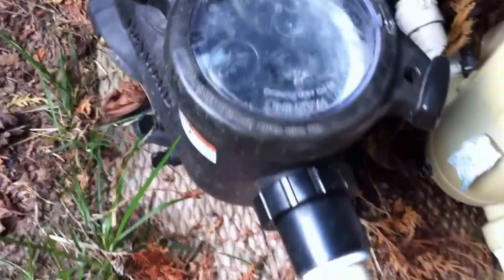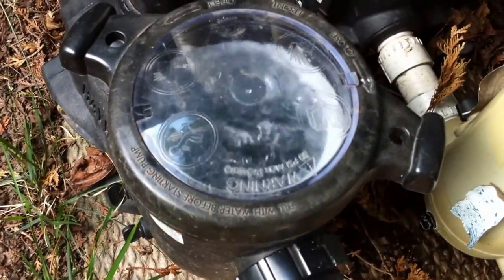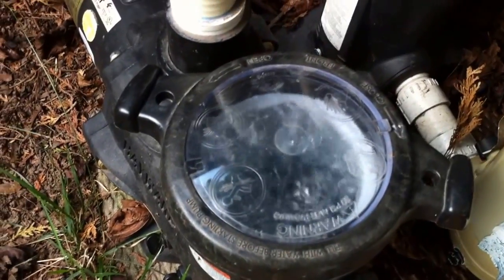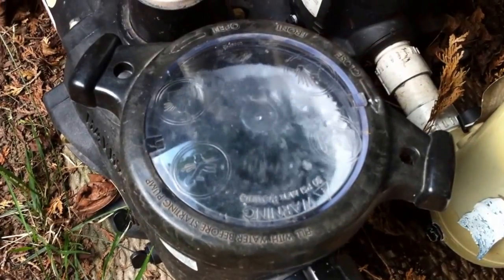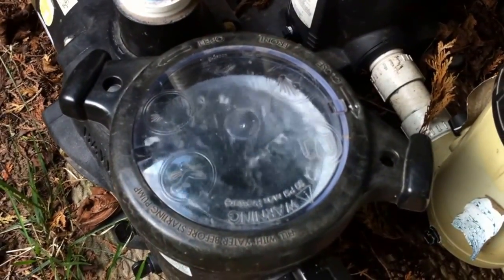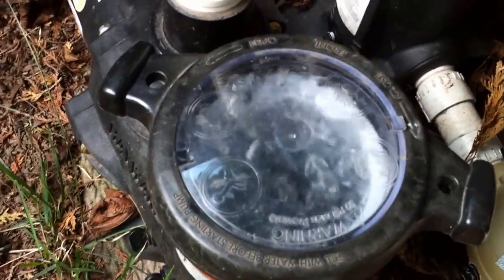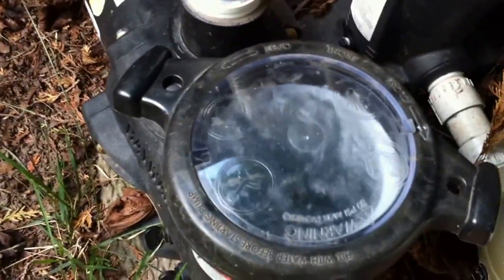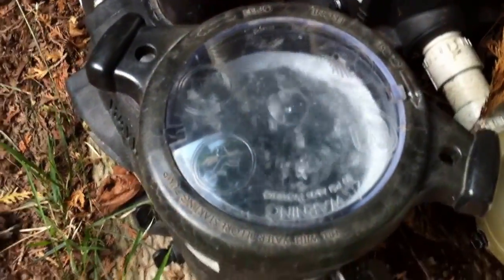This pump here is a Tri-Star, probably half horsepower. It's not running with a full chamber — there's a lot of air in there. That's a big wet end, and with some flow restrictions like that, it could be causing it, or it could be that the filter needs to be backwashed. That's something you'd typically see from a pump that's maybe not sized correctly or is experiencing some flow problems. The pump motor itself sounds fantastic — super quiet, no problem there. I think it's probably a fairly new pump and that's probably as good as it'll ever be able to run on this system.